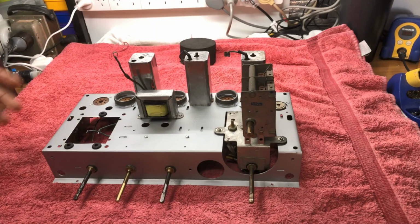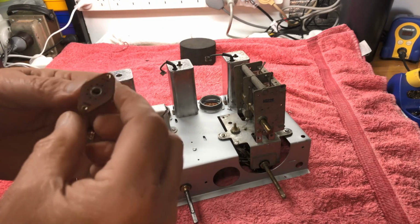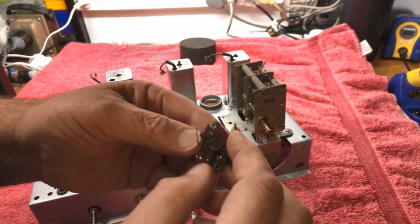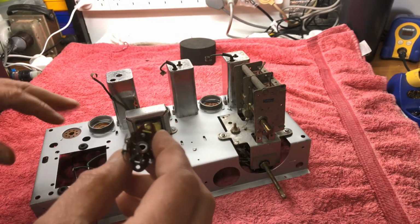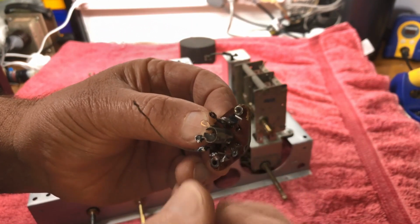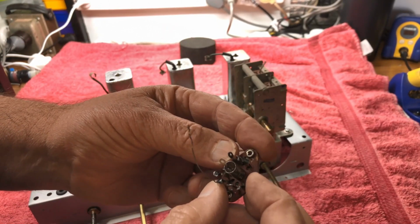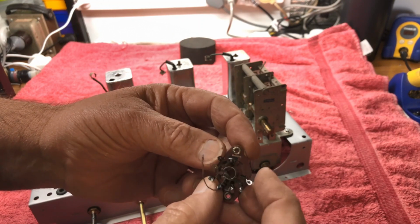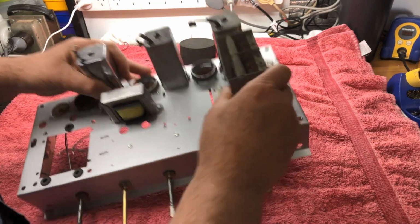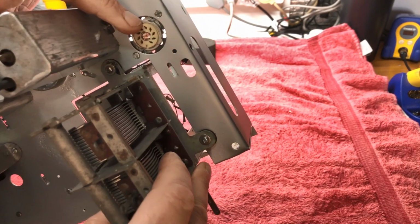I suppose it's never really straightforward when we're doing electronic stuff. What happened was, this is a 6AN7 socket. We were soldering some wires onto the pins, and one of the pins just there broke off. So, yes, what do I do? I'll have to replace the socket. So I removed all the components around it, and we've put in a ceramic socket, which I had. That's actually new old stock.